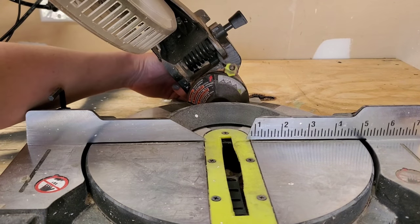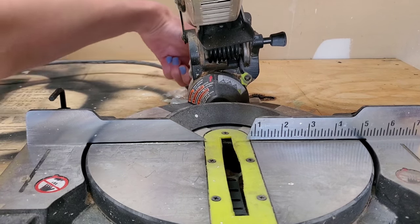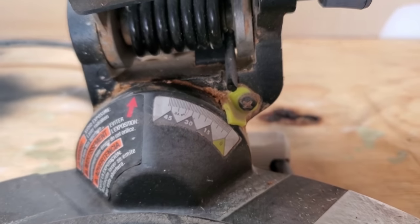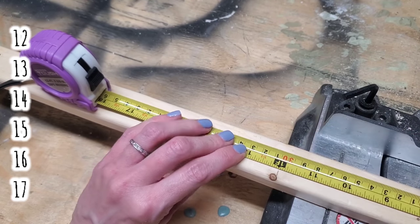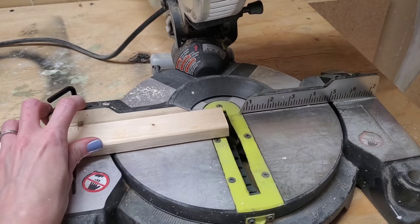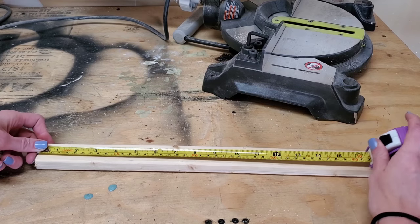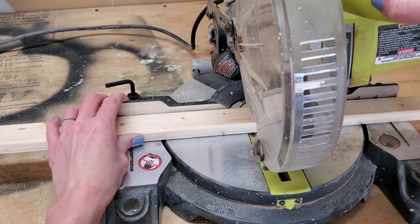This time I'm using my miter saw — a very small, cheapest one I could find, which I got when I installed our flooring. I set it to five degrees off because we're going to make this ladder slightly slanted — it'll slowly get bigger as it goes down. I measured the third wood strip and cut the rung pieces at 12, 13, 14, 15, 16, and 17 inches. You can see the pieces are slightly slanted — you can barely tell.